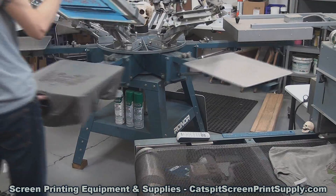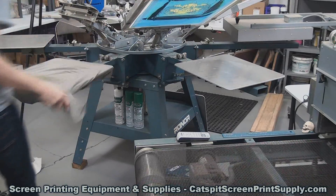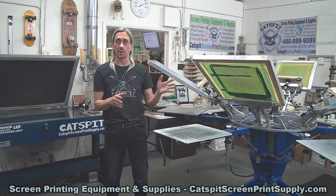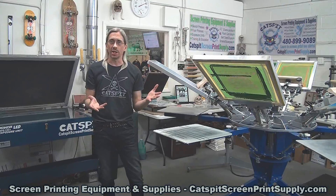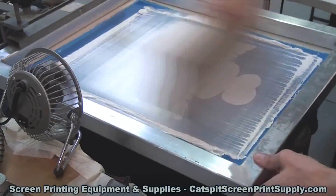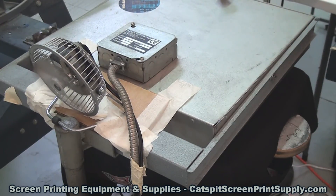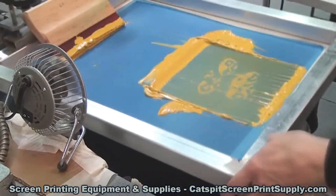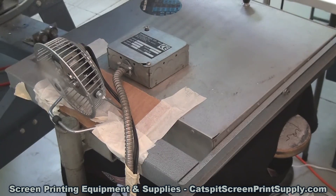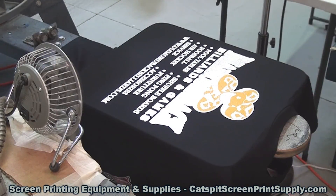To solve that in the first scenario where the ink is too hot — whether because you're running aluminum pallets on a rotary press or maybe you're on a single station press running a multi-color — you have to wait between colors to let the ink cool off and let the pallet cool off, because that's the solution. When the ink is too hot from flash curing, you want to allow it to cool before you print the next color, and that way it will not stick to the back of the screen ruining your registration.